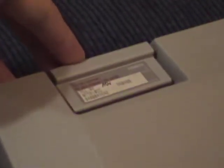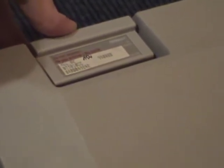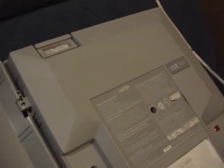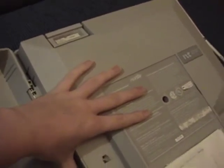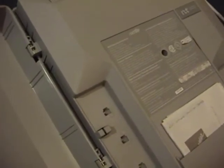The one risk with a 6x16 is it's got a removable software cartridge, and this software cartridge is required for the thing to work. Sometimes on eBay you can find 6x16s that don't have a software cartridge — they'll be totally non-functional. All Northstar models had their software upgraded over time, introducing new features. The 6x16 being one of the original Northstar models, you most commonly find them with early software versions. Mine has an early version.